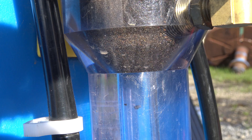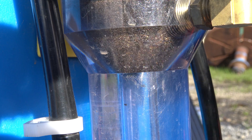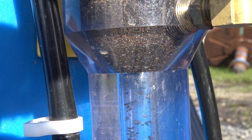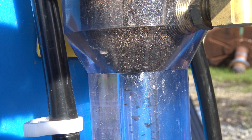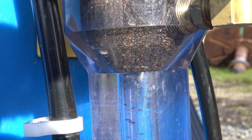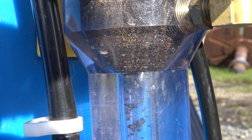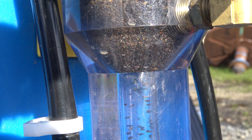We're getting a pretty good disturbance now. I'll go ahead and reduce the drop water — right now we're set at 0.5 and I'll reduce it down till we start getting the mineral to come down into the jar. That looks real good to me. I'll increase the mixing a little bit here, a little more disturbance in the trap. Okay, that looks great, so now we'll go ahead and start adding material.